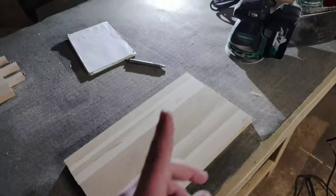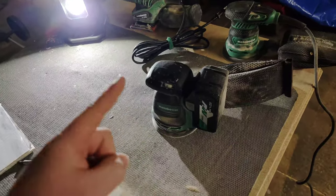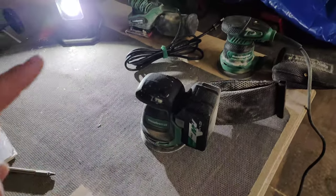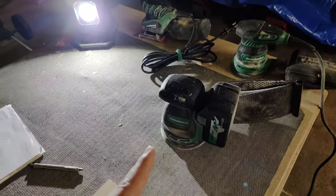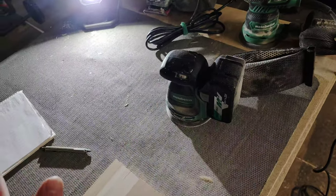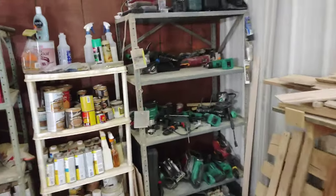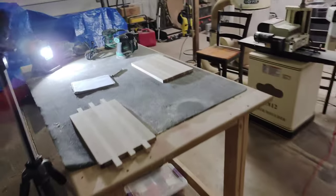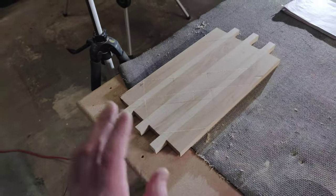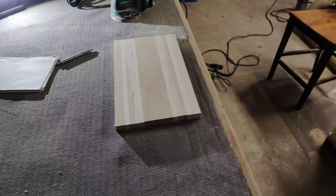I've got one more to do, then cut these to rough size, then 150, 220, 320 grit, plus a round over for the edges, feet added so they don't slide on the countertop, and possibly laser engraving on the back. Then finish and they'll be ready for the website. I didn't intend to make a standalone video today, but I guess that's what I'm doing — cool little comparison between the three handheld sanders. Metabo HPT, if you're watching: please make a six-inch direct drive sander and a 4x24 belt sander.